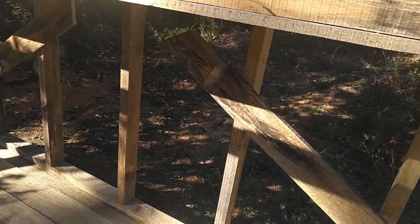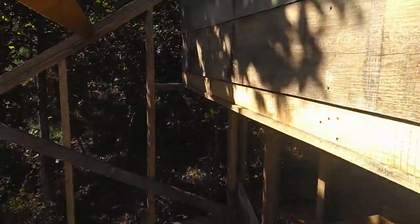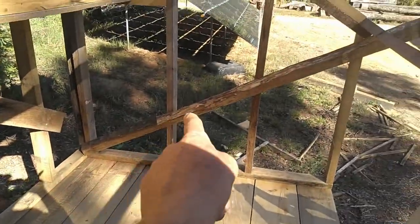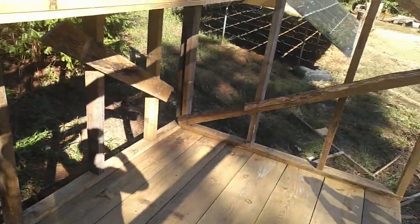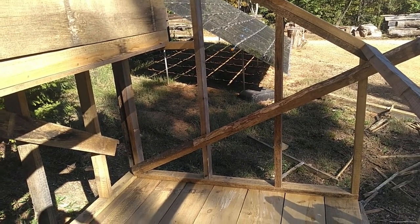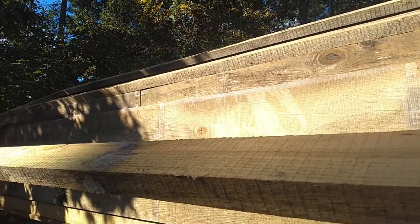The fan box is all covered up. I used two-by-twelves so that when I cut holes for the fans I hopefully don't have to cut through a whole board — that'll give me some rigidity. I've got it all capped in: two-by-fours tied in, a two-by-six to tie in the corners, sides squared off, and both sides and the back cross-tied. I am ready for skinning. Next step is heading to the box store for T1-11 — not sure what thickness yet — then insulate, TuffTex on top, front door, paint her black, and we're ready to rock.